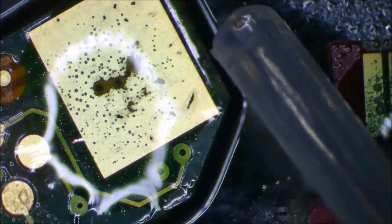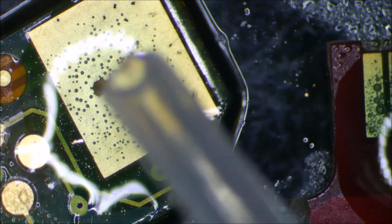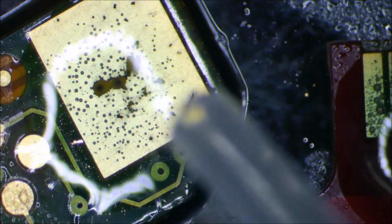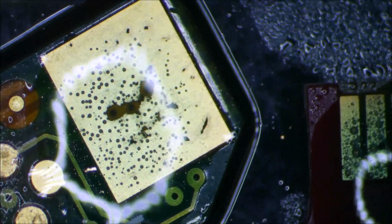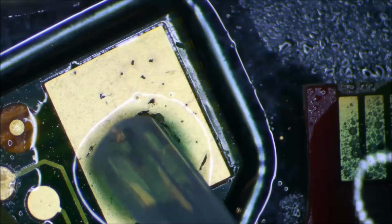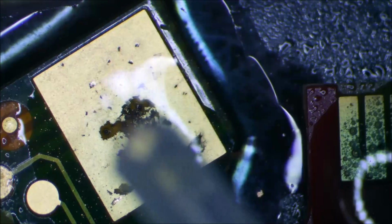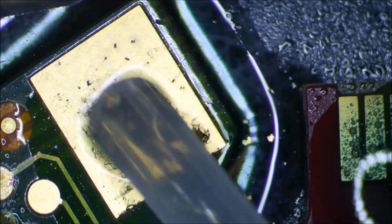So there's 3 vias in the pad. You can see that's actually been an entry point, and the gold is kind of flaked away around where the acid could get access to the copper like that. So let me just quickly do this, and then we'll give this another scrape. And once again, you can see there, unlikely that the gold from this will end up as a foil.